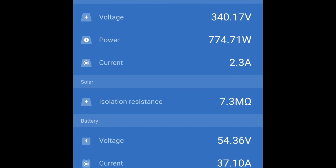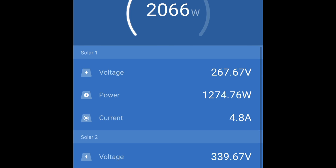It's now about nine o'clock and we're pulling in 2,100 watts. I hope you enjoyed this video. The Victron MPPT RS 450 from Victron Energy saves you money on wire size, eliminates the need for a solar junction box, and one charge controller handles so many panels — I've got 24 panels in two strings of 12 panels each, all wired in series, all going to this one charge controller. If you have any questions or comments, I'll try to answer them. Thanks for watching!